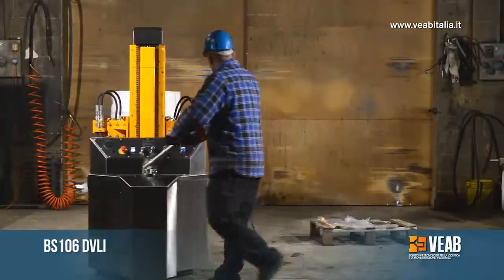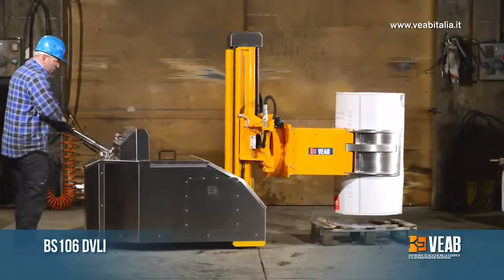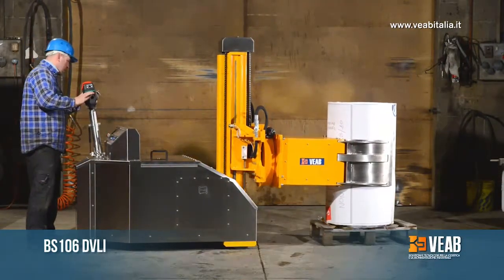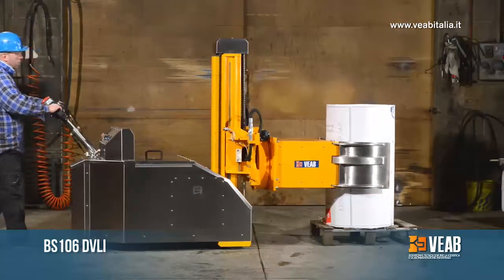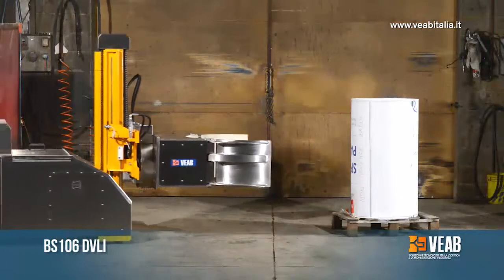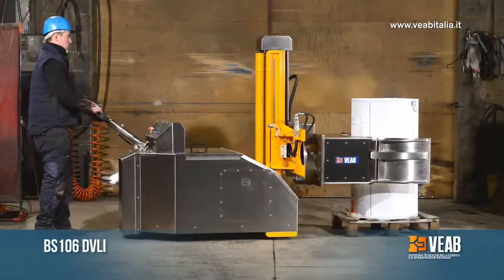The control buttons, drive, clamp raising, lowering, opening and closing, are located on the tiller arm. The trolley is equipped with numerous safety systems including safety cowlings, emergency button, battery disconnect switch in an easy-to-operate position, reversing warning alarm, electrical overload fuse, a system to prevent it being set in motion accidentally.